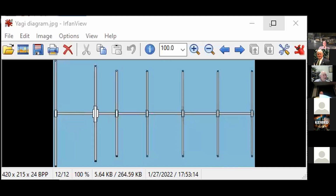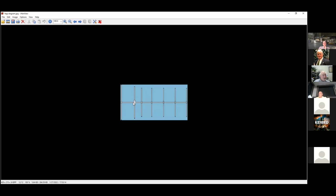Okay. Going to talk about different kinds of antennas now. Are there any questions so far? Okay. Now, what happens when you do something with your dipole? All right, for instance, here's your dipole. It's fed with coaxial cable, which usually goes down the boom. And it has these elements which are not attached. They're connected to a boom, but that's all. They don't have any cables going to them or anything of that sort. But they act as a sort of magnifying glass.